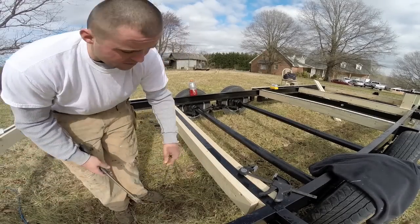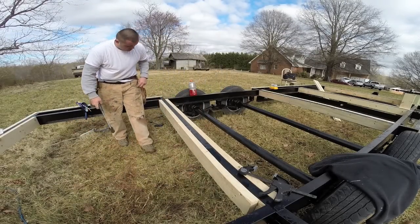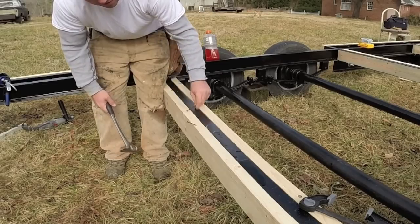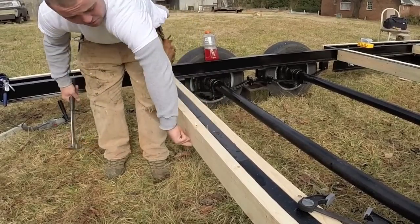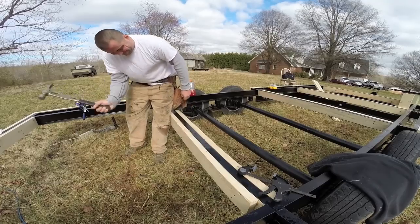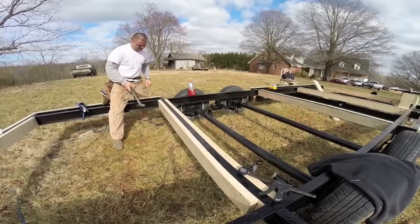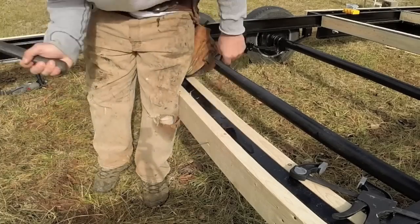This board's got a pretty bad crown in it — it's shooting up and diving off on the end. So I'm going to secure this end where it's good, and then right here where it's good. The middle's got to come down so I'm going to do a toenail — just put one right in there like that. Sometimes I find if you use two you get a little better driving force. It's perfect — well, it's too much. This end's got to come up just a little bit, so I'm just going to do the opposite with a toenail on the bottom. Set. Nice.